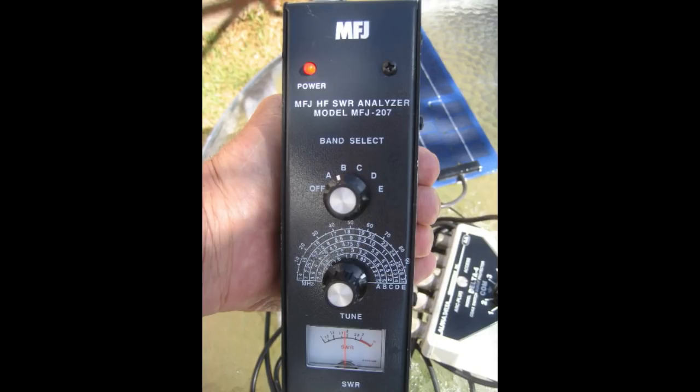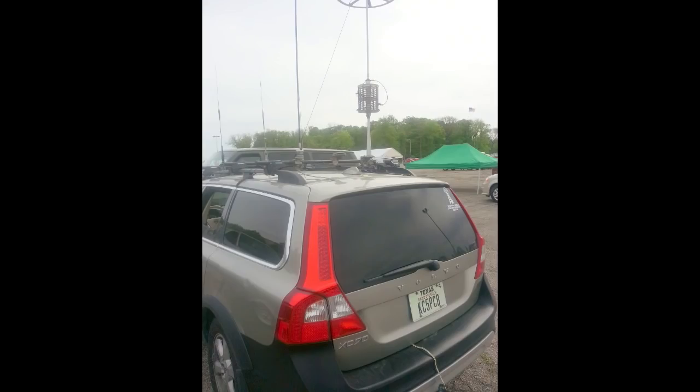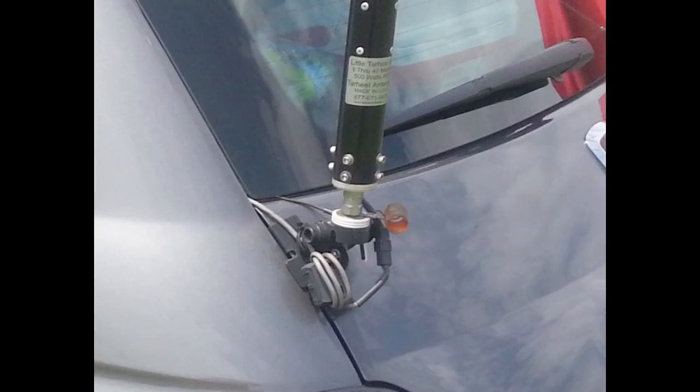So today we're measuring one, and oh my gosh, it's only down to, it looks like 3 to 1. That's not very good. And again, this is my little $99 inexpensive SWR analyzer. As long as you've got your HF radio nearby, stick a hairpin in the back, and you'll hear it sweep when you hit the right spot. We need an antenna coil. No, this is called a loading coil that you see there. This is a manual one where they tap into the different bands, but we need a coil of wire somewhere else. And there it is.